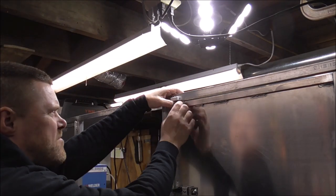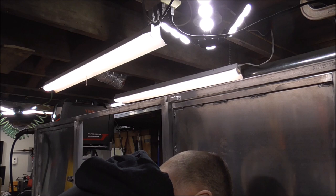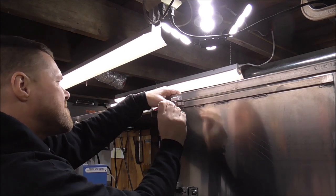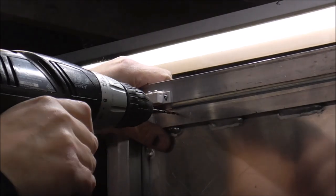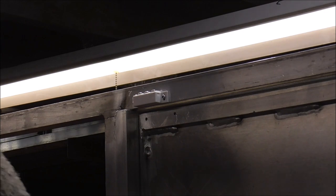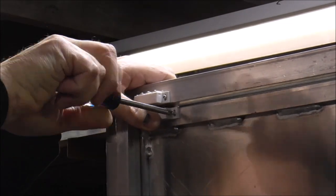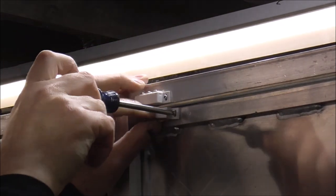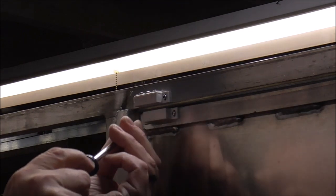This is a little far away — we may have to build this out a little bit. Maybe I'll put a little sticky pad on it. Let's use my center punch and center punch it. That left a little tiny mark right there. Try to ream them out a little bit so I don't have problems. The key is almost like you're tapping it — thread it in slowly back and forth. That seems to be the key. So I'll go through this trial and error stuff so you don't have to.